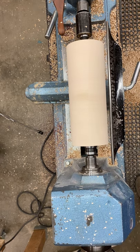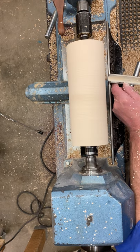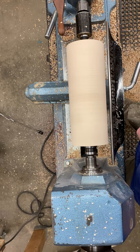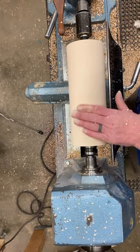By being in this position, it makes you do the landing, okay? Because there is absolutely no way that you are going to be able to get this gouge out here and be able to control that with your hand at the ferrule. So, get that up against your body, and just come right across. We're almost around.